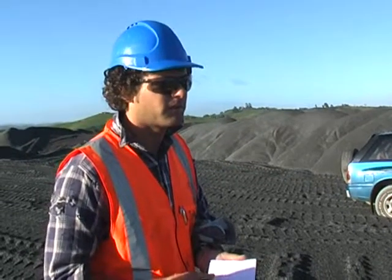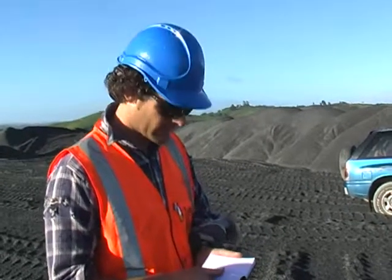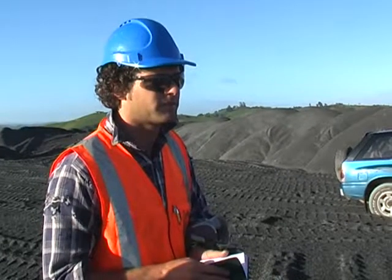Well, 25% is already added in there. Yeah. But also, what was your final answer you came up with? Final answer was 1.8 tonne. So what winch will you require? 2 tonne. Good, yeah.